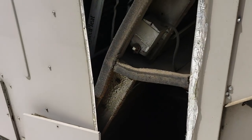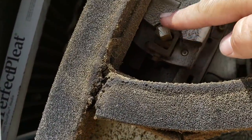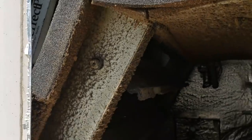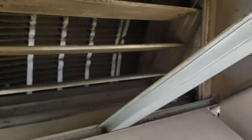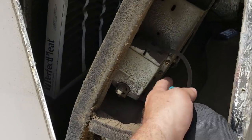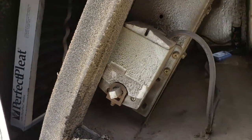I grab the damper and it closes by hand. Then I notice — if you look at this — that's actually moving inside the actuator motor. It's not tight on the block, the set screw pin coming through is basically not tightened down on it. The economizer is opening strictly due to the airflow — it pushed these dampers open so they're just sucking outside air into the building, into the kitchen, instead of recirculating. I'm not sure if the actuator motor is bad, but I got in there and tightened it up. That little Allen set screw, I got it torqued down.